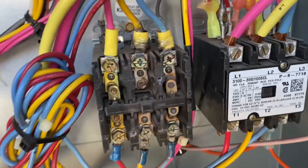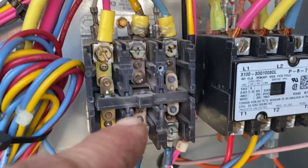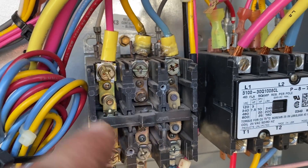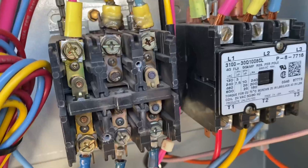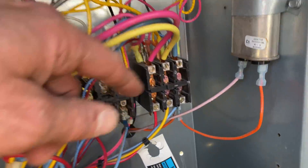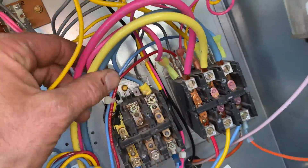Check out what I found. So before condemning, I'm going to have to test this wire and change the contactor. I'm going to put the yellow together — just jump it. I spliced wire to get this yellow wire together to bypass the contactor.